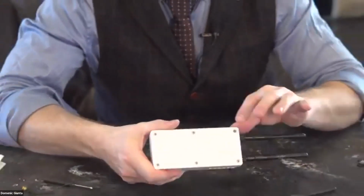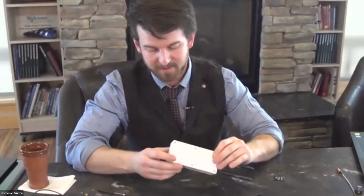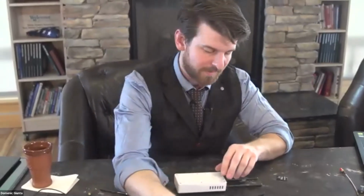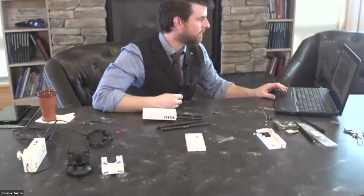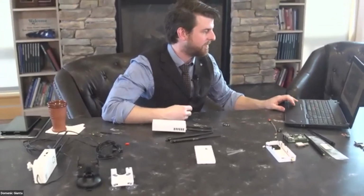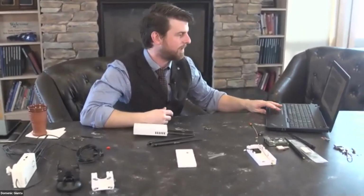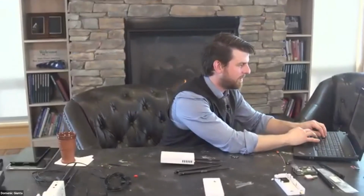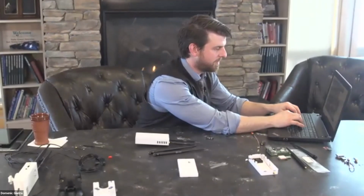All right, so we have our antennas on, our cases together. We have our GPS and our Stratux receivers on the inside. The last thing we need to do is put data onto a micro SD. And I'm going to go ahead and screen share what you need for that. So you will need to download a bit of software. It's called etching software or flashing software. The free one that I use is called Balena Etcher. I'll send that in the chat right now as well.